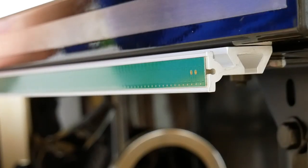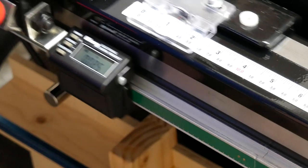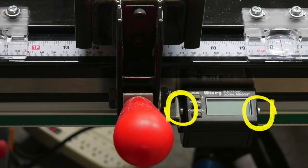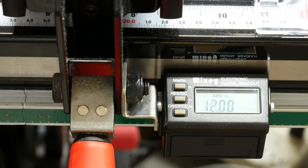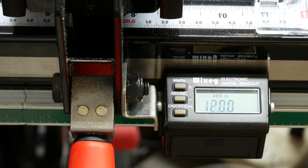The reason it's so accurate is these sensor strips that go on the track. It also has an incremental setting that lets you move the fence relative to a specific position. These magnets keep the gauge next to your fence, on one side or the other. The magnets also make it easy to take your fence off and put it back on without messing up the gauge.